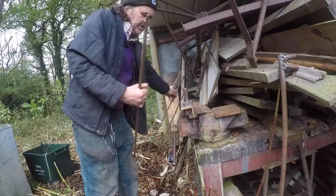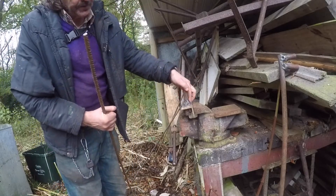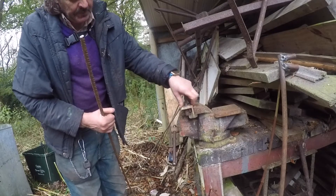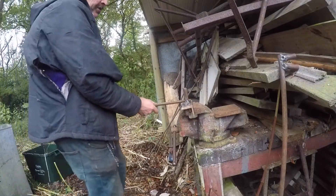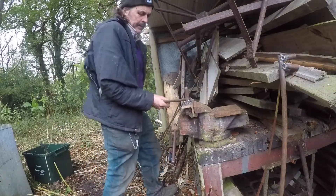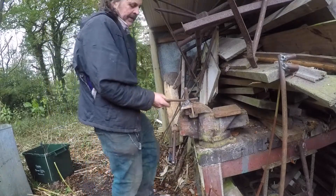The technique I'm using here is a couple of pieces of 15mm rod welded to a piece of one and a half inch by five, or six millimetres probably, one and a half by a quarter angled iron. And the way I'm doing it is without any heat at all, so it's just raw bending like this.